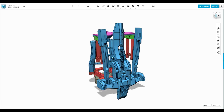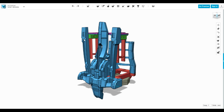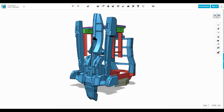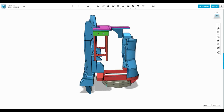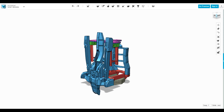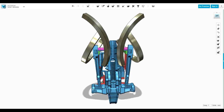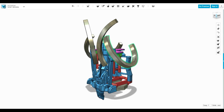This is what we've got already, and basically I've put those cosmetic parts into the same CAD drawing as the other bits and the spine we did before, and I've merged some of these into large solid chunks, which makes memory handling easier — 123D will go a bit quicker if there's not lots and lots of parts. It's really easy to merge parts: all you need to do is take the merge menu and select two parts, and then they'll suddenly become one part. I've decided to start fleshing out the main proportions here.